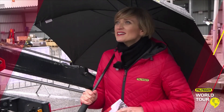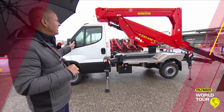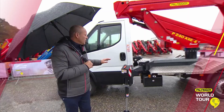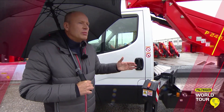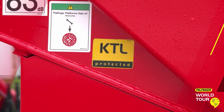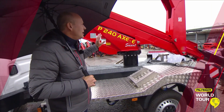That video did give us a really good impression, but now Frank, can you tell us a bit more about the details? For sure. So if you look at this machine, this is a P240AXE E+. E stands for electric controls, as you know — I will show this to you in a second. Here we have the Iveco version, which helps us have a compact machine also for narrow environments. We have the ability to have three positions for our outriggers: all in, both out, or one in and one out, so you can adjust your working space however needed. All the structural parts are KTL coated — taken over from automotive — which provides high quality protection against corrosion. No more concerns about corrosion at all.